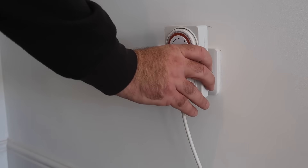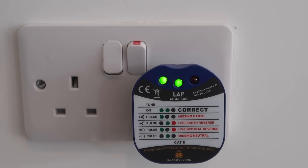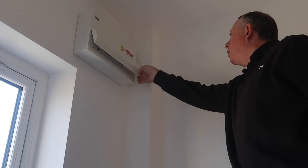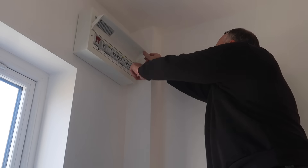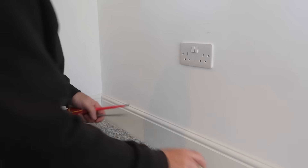The first thing I need to do is work out what type of wall this is. When I knock on it, it sounds fairly hollow, but I'll only really find out once I take that socket out. So first I need to turn off the electricity and open that socket. I start by using my normal routine of plugging in my socket tester that has an audible tone, then turning off the correct breaker in the consumer unit, which I know I've got because the tester stops making a noise.